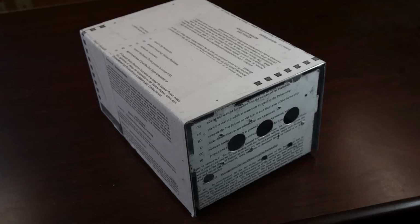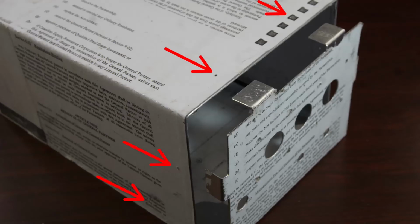We can now start preparing the holes for the attachment screws. Early on, I drilled 12 pilot holes around the perimeter of the cover. These pilot holes should now be pretty close to the centers of the folded over tabs of the base. Remember that I didn't drill any holes in the tabs. I'll do that now. The base and the cover will not have been bent perfectly square.